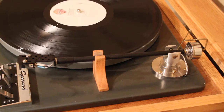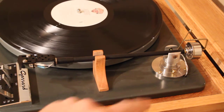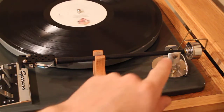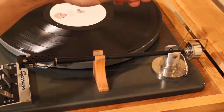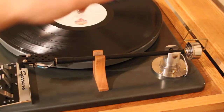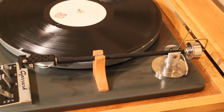After doing some research, I settled on a combination of a Schick tonearm and SME. The Schick provides the main pivot and the clevis that pivots here, and from the SME I borrowed the design elements for the bias weight mechanism.